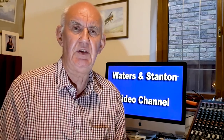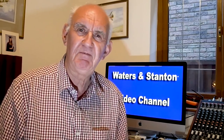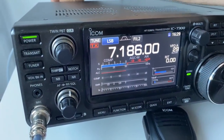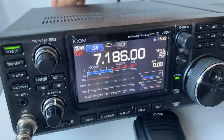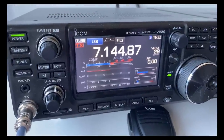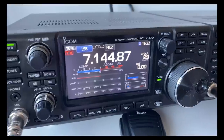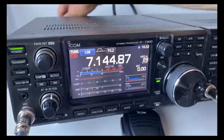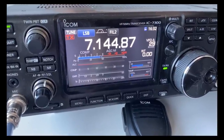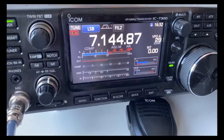The antenna I used, as already covered, is 53 feet — sorry it's in feet, but that's the measurement I made. If you want to convert to metres, pick up your smartphone. Now just a couple of comparisons of on-air signals on 40 metres. By comparison, this is on my main 40-metre dipole, and this is the Unun. Again this is on my main dipole, and that's switching over to the random length of wire. There's not too much difference.